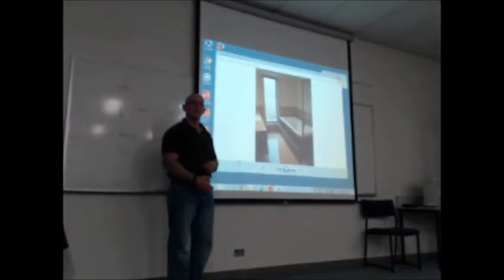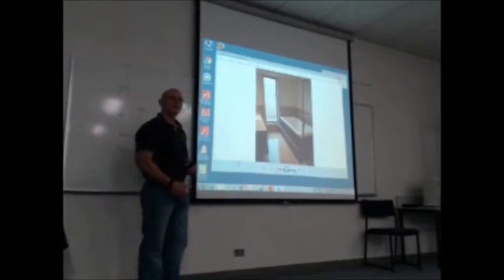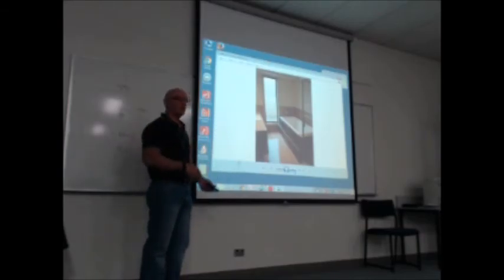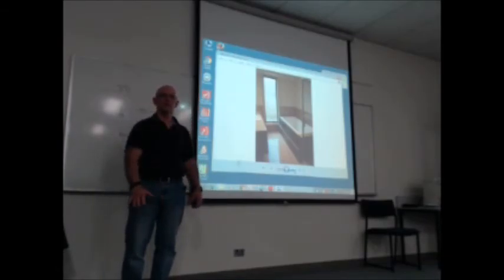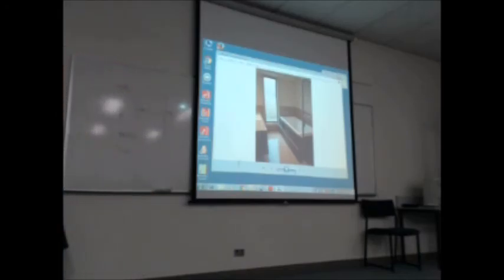Is there a regulation about the height of the step into the bath? No. If you had a bath that was 500 off the ground like that thing is, it wouldn't have looked right, it would have looked too boxy. It's a feature as well. Like I said, that's a plunge bath, so it's about 700 or something. It's a beautiful bath, so you'd want really strong support under it. Yeah, big footings.